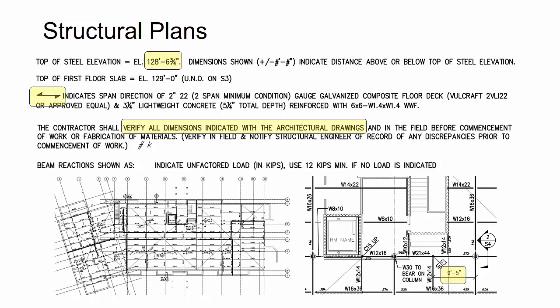So that means the engineer is locating and sizing pieces in coordination with the architect based on the design and requirements that are needed. So I'm depending on the structural engineer to tell me exactly where and what sizes of pieces are being located for his frame. And now what I'll oftentimes do is I will then just go ahead and give my best guess or a scale. Sometimes I'll reference the PDF actually in my model, and if it's to scale, I'll locate beams if they're not obviously centered or called out by the engineer to be centered in a bay.